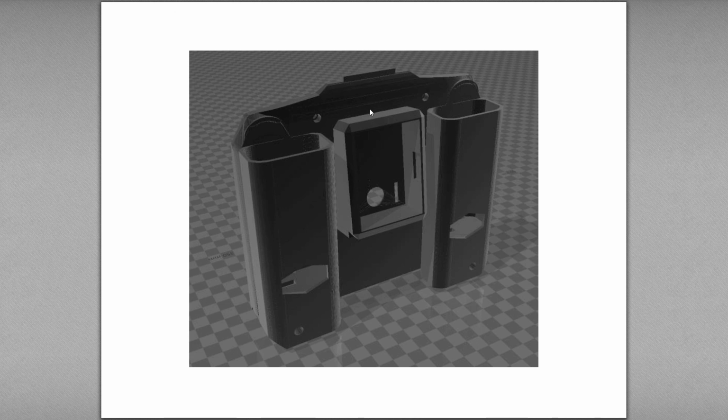I actually have a buck converter inside of there too that regulates at 5 volts. But I'm not sure. I may make that buck converter accessible, or put a second buck converter on. I should actually put a second buck converter on. If I install another buck converter, then I could ramp it up to 6.5 volts, which is the minimum the R9M likes to have for the external plug sticking out the back. And then I can power off the USB bank with the step-up converter.